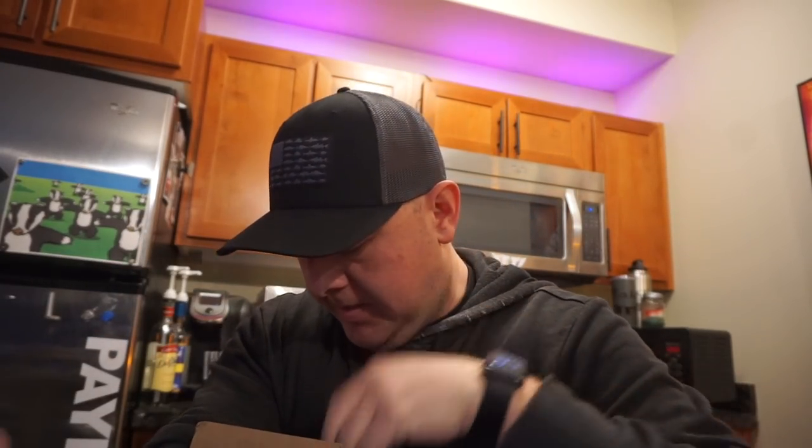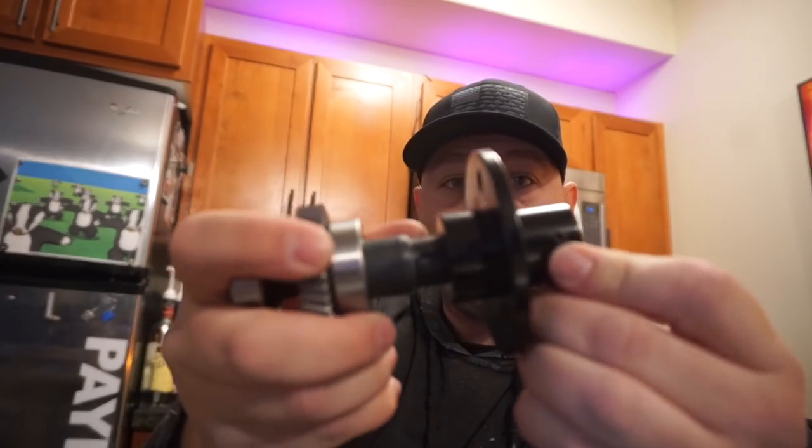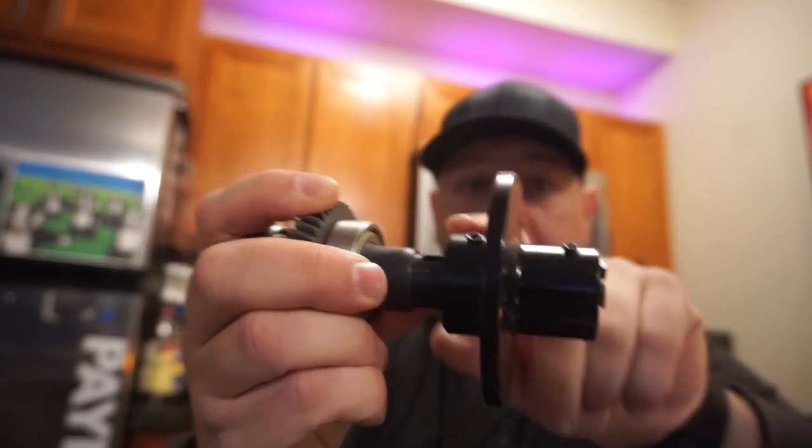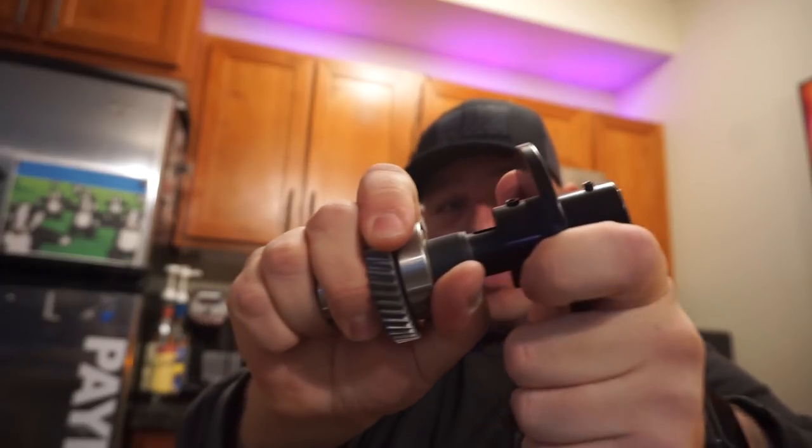I think now we should be ready to install these replacement parts in the off-road chair. We've got our modified hubs, the hardware kit, and the motor shafts. After the shafts are on, we tighten down the set screws with an Allen driver and there will be no more slop — these will be positively joined together. I did just realize something though — I don't think there are any gaskets.